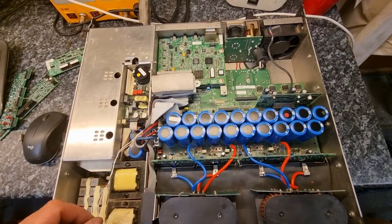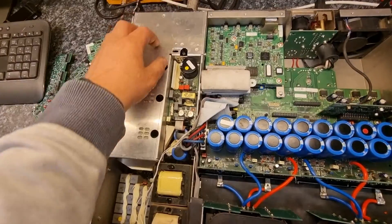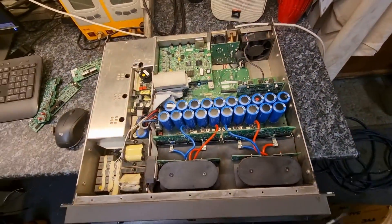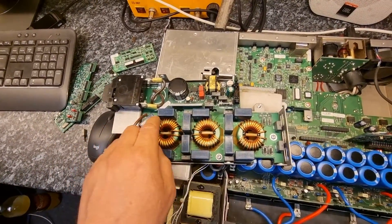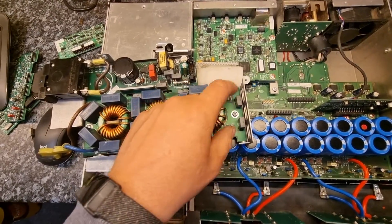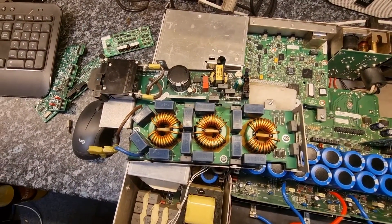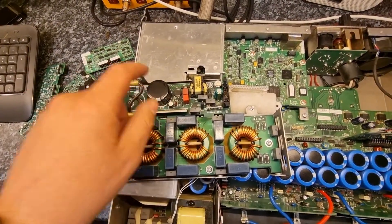A very quick overview of how these amps work: you've got a power supply under this section here. This top section under this metal case is your EMI filter, which looks like this. AC comes in through here, goes through a filter network, and is presented to the amplifier via these terminals. On this side there is a constant plus/minus 20 volt power supply that does the standby stuff, and it's on all the time as long as the breaker is on.